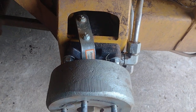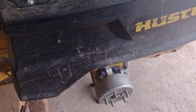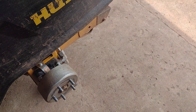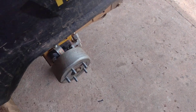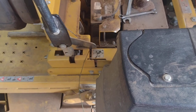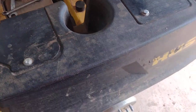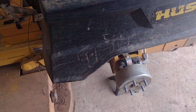It'll make that lever get further that way. How you know it's adjusted properly is you can't turn the tire when the brakes are engaged. You may have to do it a couple times — you can do it by hand, trying to spin the tire, or put it on a hill and engage the brakes to see if it'll hold. If it doesn't hold, come back and tighten it a little more. Just make sure that when the control lever is all the way out and the bypass is disengaged, the wheel will still spin. Appreciate you checking it out — hope that helps somebody. Till next time.